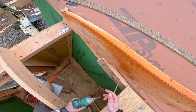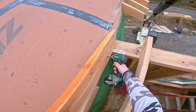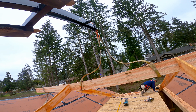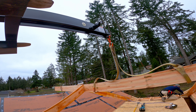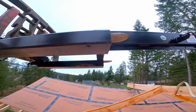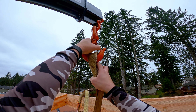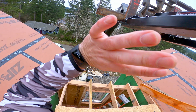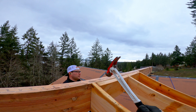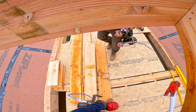Here's how we did this: because we had the truss jib we just suspended the ridge. We pre-screwed the rafters where they needed to go with those Simpson screws from the last video — that was just temporary in case we needed to move something. Then we nailed them perfectly at the ridge, it's self-supporting, and we can pop the screws out to reuse them since the nails hold it. The ridge stayed suspended and we used four rafters to get it all locked in — that way we didn't have to calculate or measure any ridge posts. There's always some kind of variation and we just skipped it all by using the truss jib. Setting up on posts might have taken half an hour to an hour; in this case it probably took us 10 minutes.